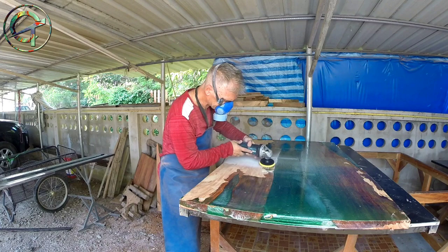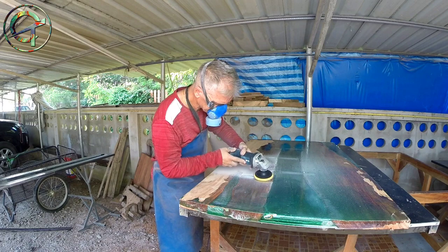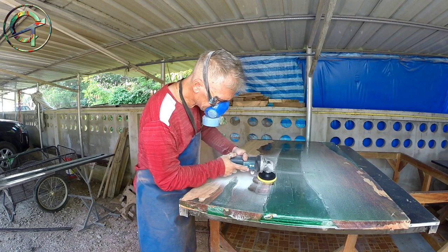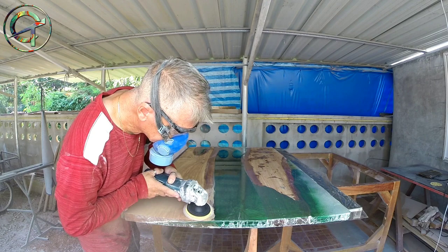I do the sanding beginning with the lower part of the table, then I repeat the process on the upper part. I should be careful because a grinder saves a lot of time and effort. However, a grinder is an unforgiving tool — it removes a lot of material at once. I should use it wisely, because too much pressure, too steep angles, or spending a long time in the same place means making holes and screwing up the piece.